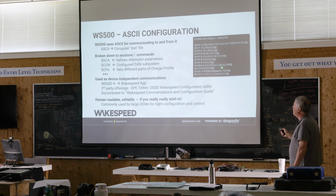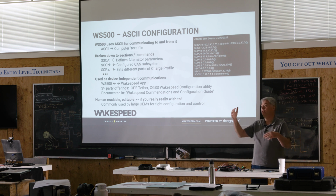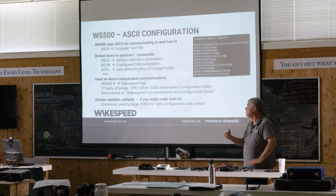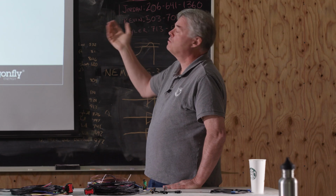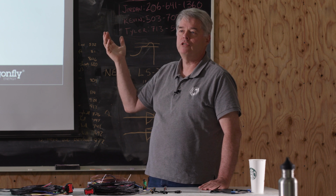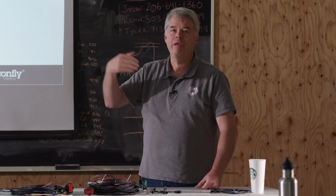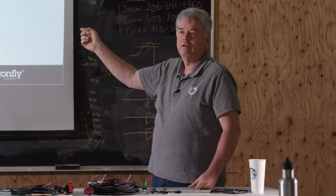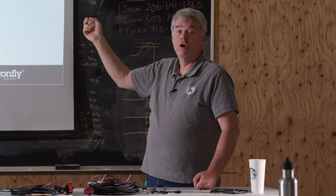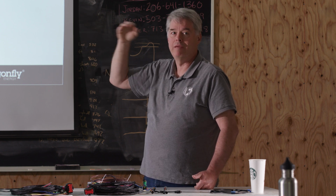So in here you define temperature limits, you define the C rate. We also have the ability, as you're reaching the extremes, to do a reduced C rate. I'm just going to tell you, it will stop charging above 45 degrees C and below 5 degrees C. It just won't charge. I don't care if the BMS is asking for it. We will not honor that and we'll override it. It's a double check. If you don't want the regulator doing that, you just put zeros in for those parameters or -1s. Everyone's a little bit different.